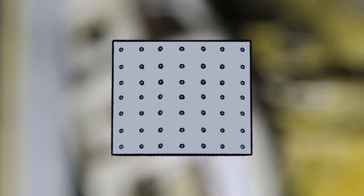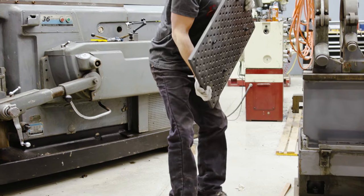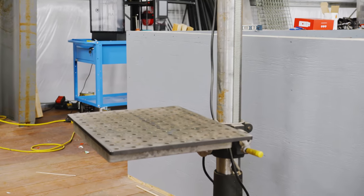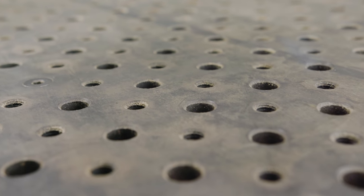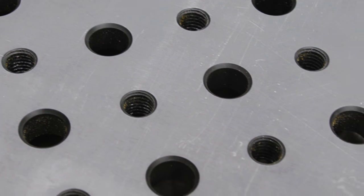Because I'm going to be building several components to mount to the shaper, I need a nice sturdy base plate to start from. This is a drill press fixture plate that I built to expand your drill press table, but it's going to work perfect on the shaper here for this fixture, because now I can put anything I want using the 5/8 inch holes or the 1/2 inch 13 tapped holes in between. So this is the perfect base for this setup.